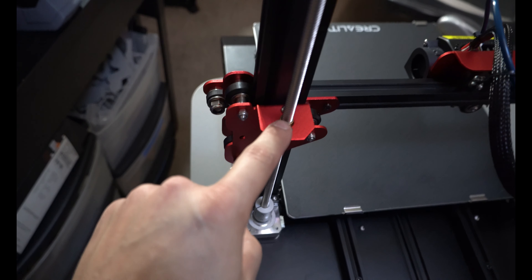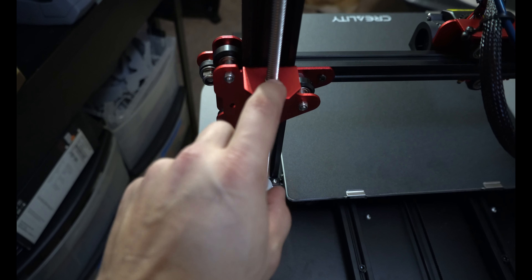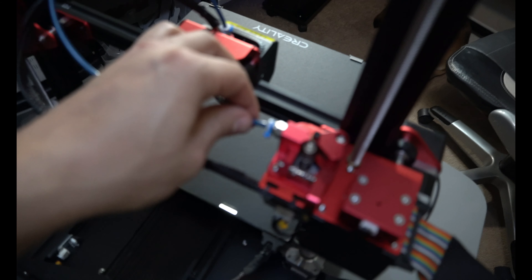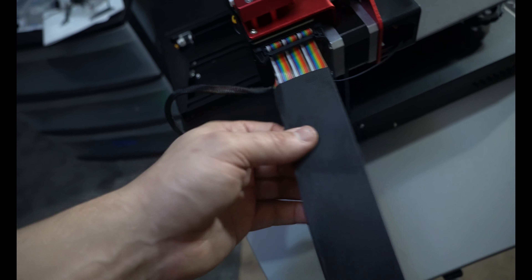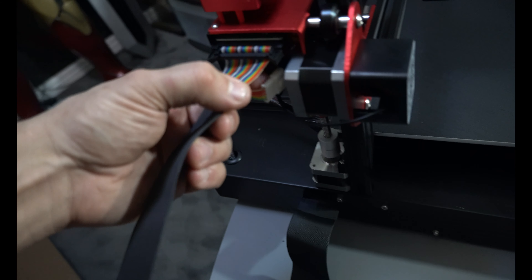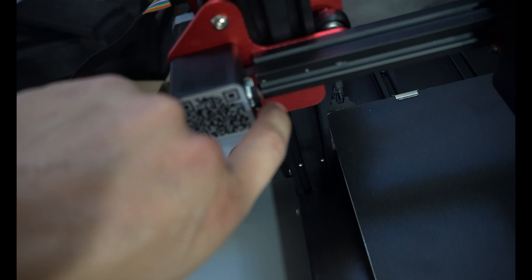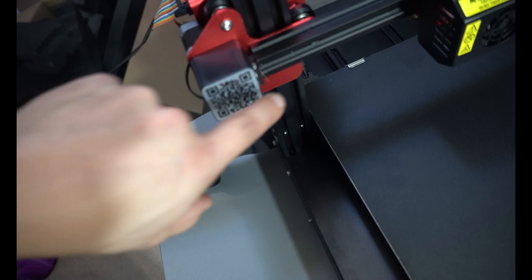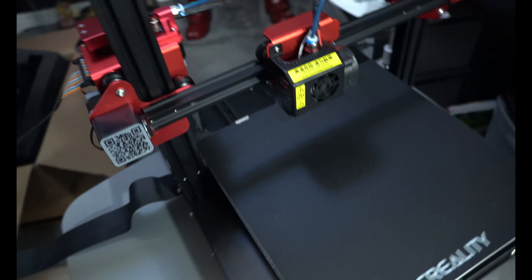The screws on this rod — maybe these are supposed to be loose. That's totally fine, that's normal. Don't go ahead and tighten those down. Back here is where that eccentric nut was that I tightened before. Make sure your extruder is plugged in, your Bowden tube and hot end look all right. Make sure your BL touch is plugged in — that's what that white plug down there is for. You're going to want to make sure you have the little trigger still there. You'll only have two triggers on this type of model: an X trigger and a Y trigger. These are your end stops. The BL touch in here is actually your Z stop.